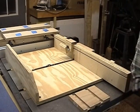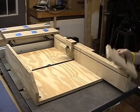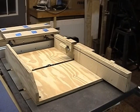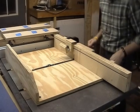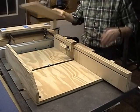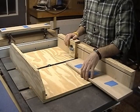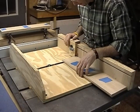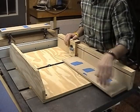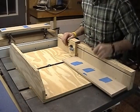we're all set. All right, so now I can go ahead and make my cuts on my actual work pieces. Outstanding. Make a slight adjustment on that. Now I can go ahead and flip my stop block down and make my 2 rabbet cuts on each end of the boards, and then I can reset my stop block to make my 2 dados.